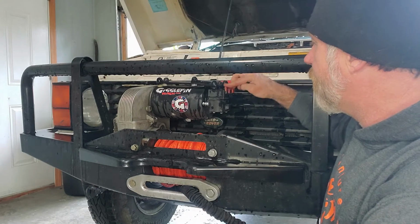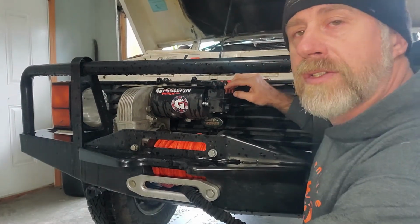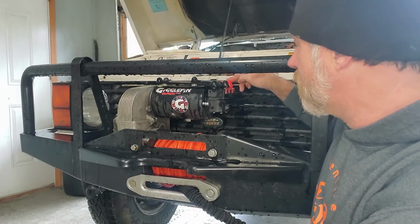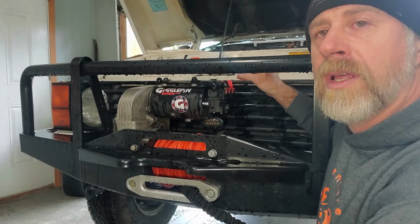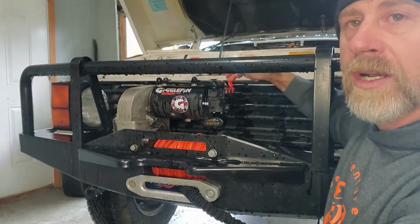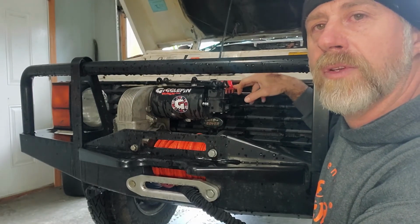So if you have tested motor, solenoid, it's all good, everything's working, and then you've decided it's your transceiver or even your handheld part that's not working, it's still really easy to power a winch. You're just drawing off your power with the same thing, a 16, 18 gauge wire. You can do it with jumper cables if you want. You're just running off of your main power, off your battery, which is also right here, and you're just making a jumper wire and the ability to put power to one of your 2 outside spades at a time.